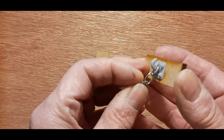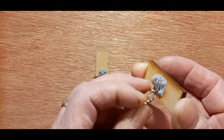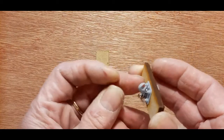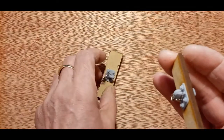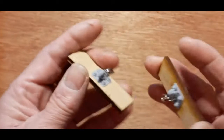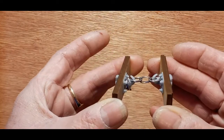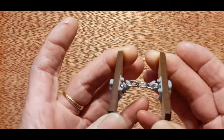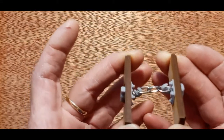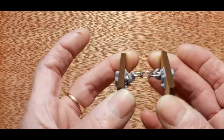As you can see, it's basically based on the normal design of a three link coupling, and what we're going to be doing today is a destruction test. I've got no idea how strong this is going to be or even if it's strong enough. So I've constructed two identical ones and we're going to hook them as they would in the real world. I'm then going to exert some force to pull them apart by hanging it and keep adding weights until we get a breakage. We'll take a note of what weight it breaks and which part breaks.